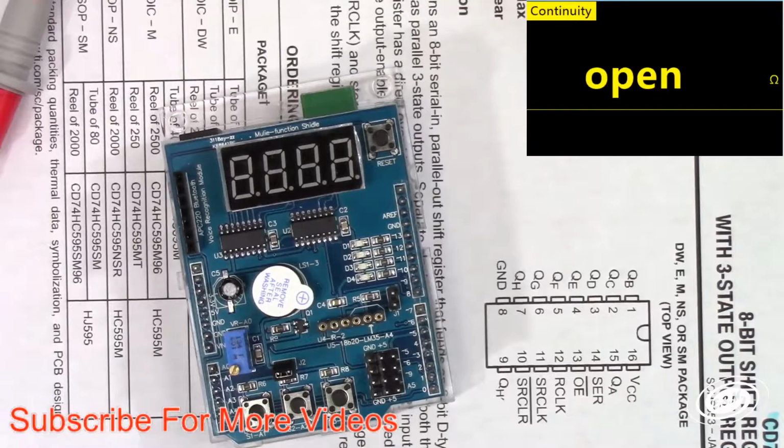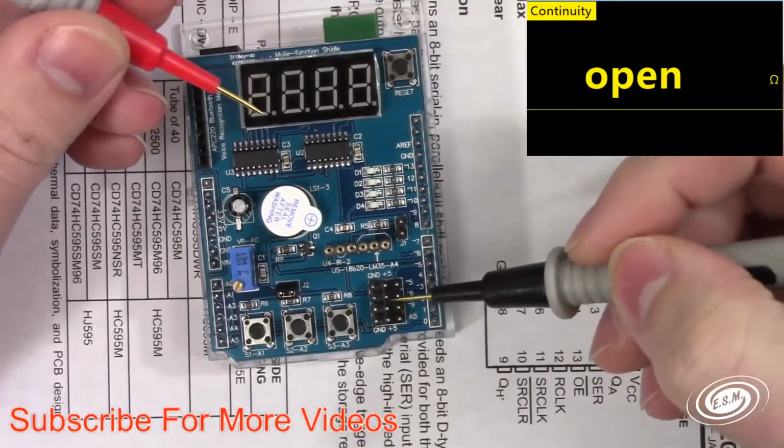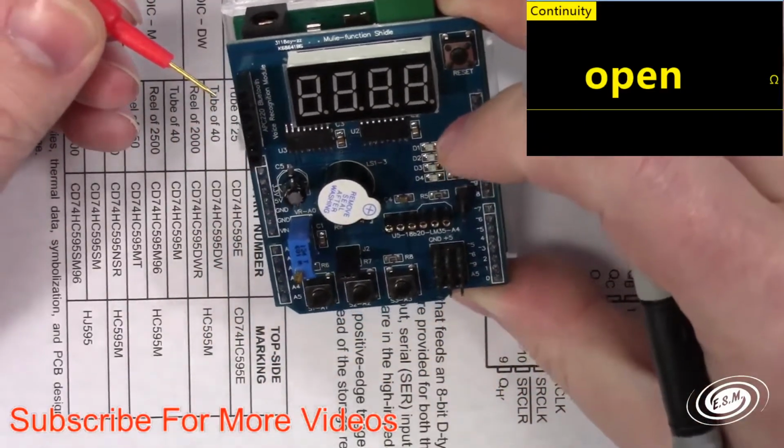And D4 does not have PWM, D8 does not, but D7 does. I don't know why our serial clock needs PWM. I would have reserved some of the PWMs for external use. I guess you can pull it externally through here. All we have left to work out is this buzzer.